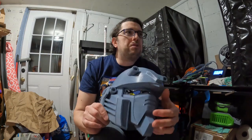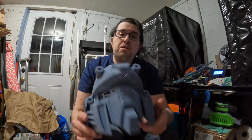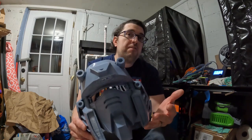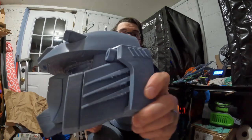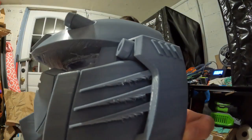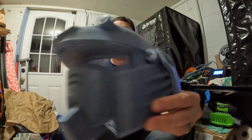I had the speed going at about 130 to 140 millimeters per second. Initially I was going at like 150 to 165, because at the bottom I can go much faster. And as you can see on the sides, there's some pretty nice detail — just a little bit of cleaning up right here, but nothing too serious, which is great.